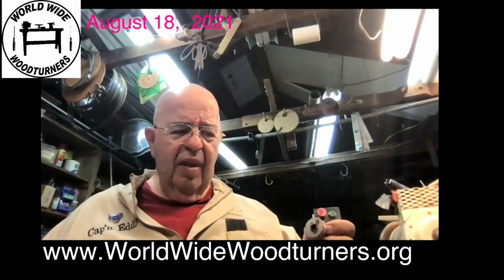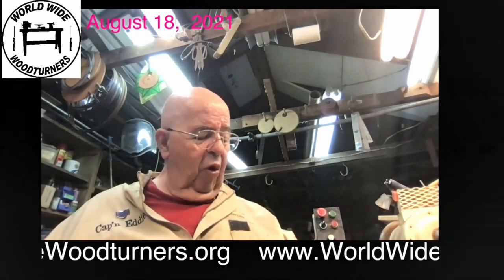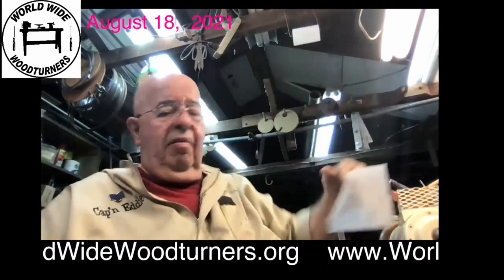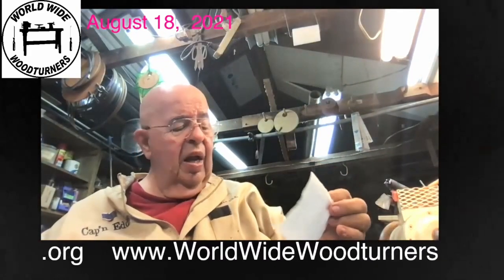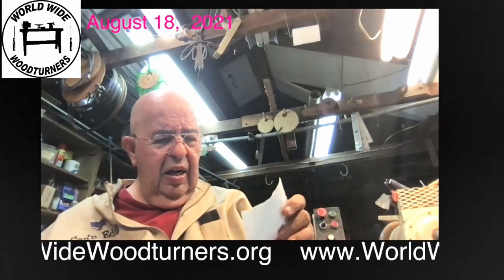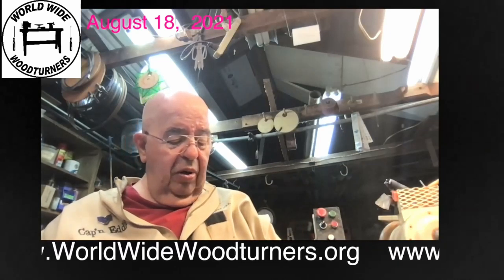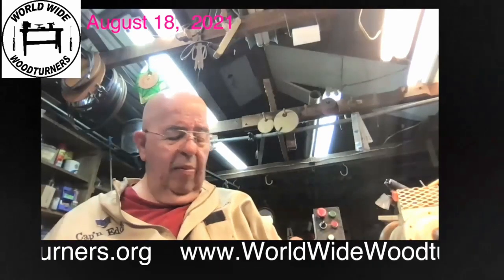I find that if I had stopped early, realized it, performed the CA fix and gone back on it, that and a little piece of miracle paper, they sell it like toilet paper, that'll help. Even a piece of wax paper. Just make sure anything you put in is not so strong you can't get it back apart. With this, I can get it back apart. If you use something that will react to the CA, you might as well hit it with a hammer. It ain't coming off.